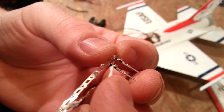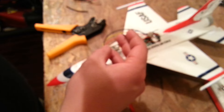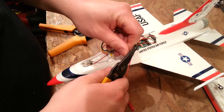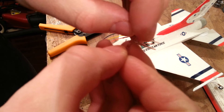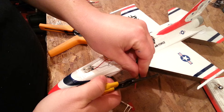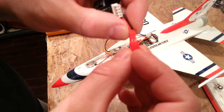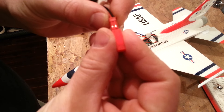It's tremendously difficult to get this thing to focus. So you're going to feed in your wire so that the copper goes into this bite point and the sheath goes here. You really need to strip back about two millimeters to be on the safe side. Take your black or red lead — it doesn't matter which one you do — grab and strip back approximately that much. Actually got a little bit too much that time; you don't want that to shoot through into the front half of your connector, so trim a little bit back.